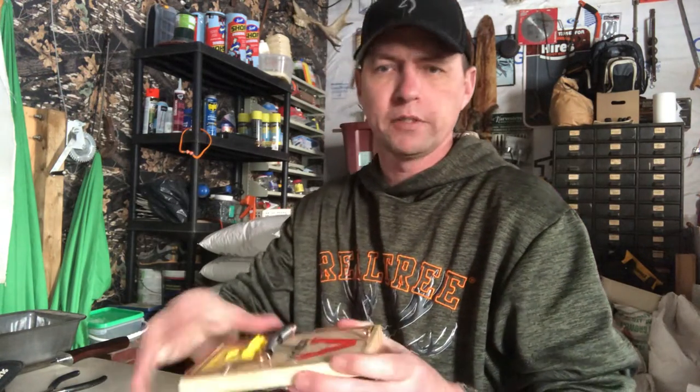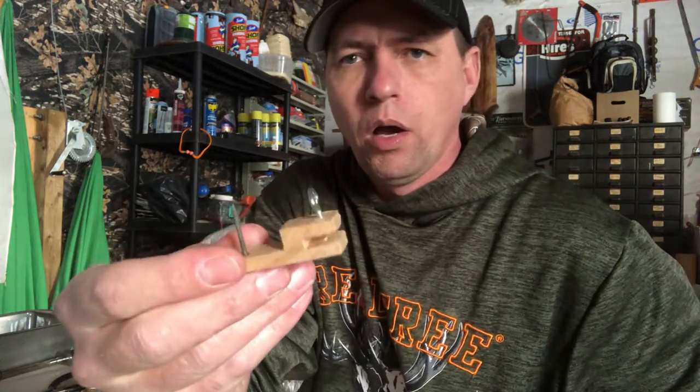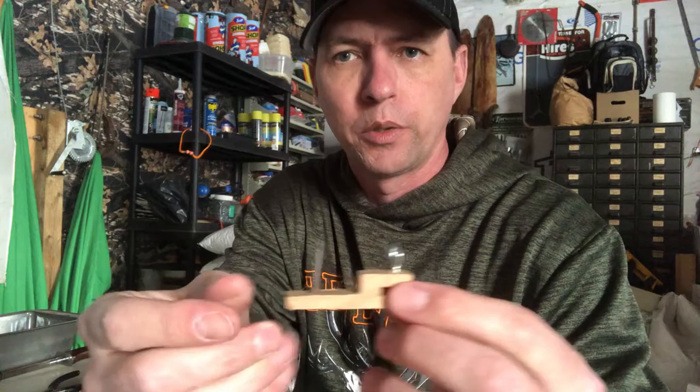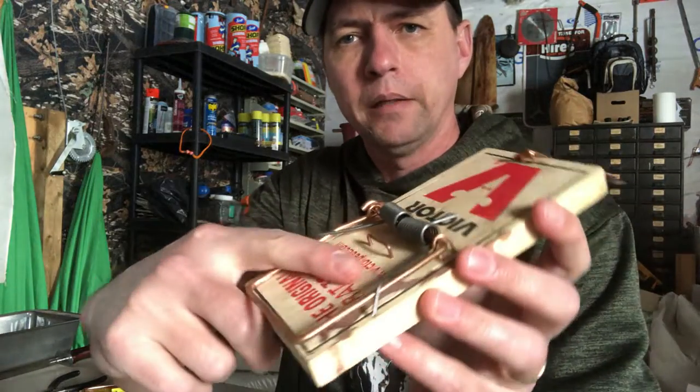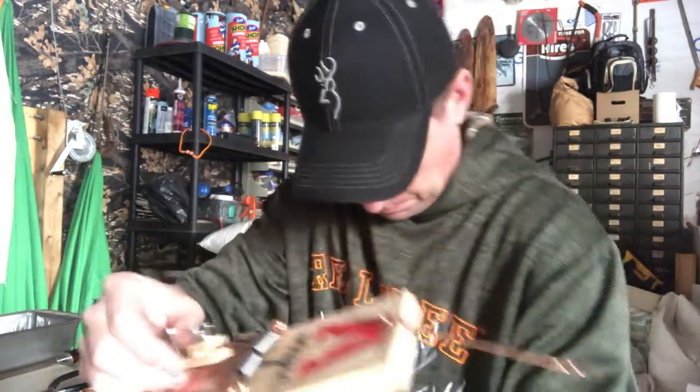What I've done is build a trigger system that looks basically like this. This is not my original idea — I saw it on a video — but I've changed it and worked out the instructions. It's just an eye hook and a piece of wood, or ideally a piece of plastic or Teflon. You put a nail or a screw up through the bottom. You pull the copper pan off, leaving just this big rugged staple, and then you slide your trigger system in.